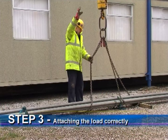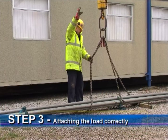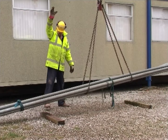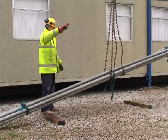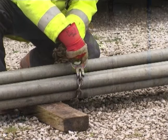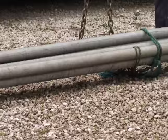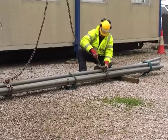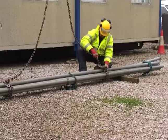Step 3: Fitting the sling to the load. Now we're ready for the next step in our lift. But which slinging technique is the best? The basket hitch used here is not a very suitable method, because the load will almost certainly slip out from the sling legs. The safest, most efficient slinging method, especially when lifting a bundled load such as scaffolding poles, is to use the choke hitch. The choke hitch grips the load firmly. The slinger has gone around the load twice with the sling legs — this double wrapping increases the clamping force without the need to batten down the hook, which is dangerous and can damage the sling.